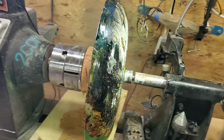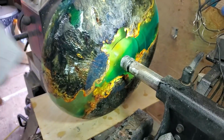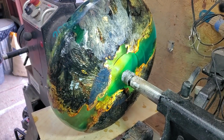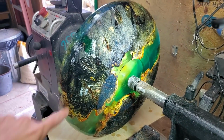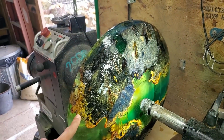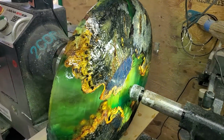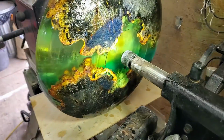So this is what I got so far. Just the backside. I have penetrating resin sitting on it, so that way I can go in and start sanding. And I had to fill some craters because there's obviously some craters inside that burl that the resin could not get to. So it's turning out beautiful. I can't wait. So there's a few tips that I hope are helpful.